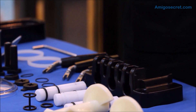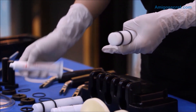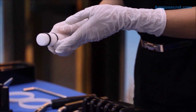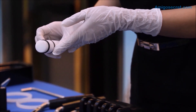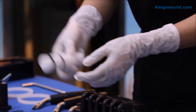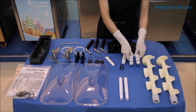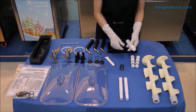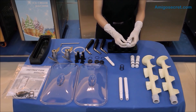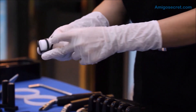After putting on the rings, we need to apply the approved food grade lubricant on them in order to reduce the friction between the draw valves and the freezer door. For the central draw valve, put on the O-ring first before inserting the H-ring. Apply some lubricant and follow the groove on the draw valve and make sure the ring is properly inserted.